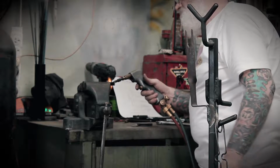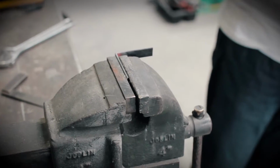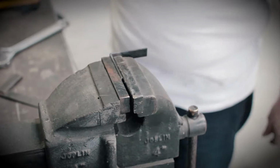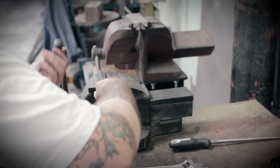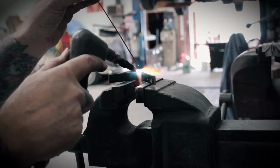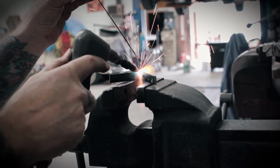Some artists put the strap in a vise and just bend it, and that's fine, it works for them. Having the jewellery background, however, Colin is used to different thicknesses of metal, and in this case, he'll actually cut a recess and then bend, so that it's nice and clean. Then he'll fusion weld, as steel on steel will give a stronger weld point. This will then be filled later on with brazing.